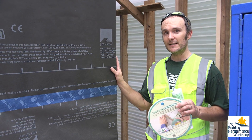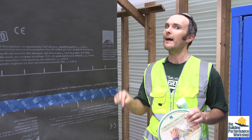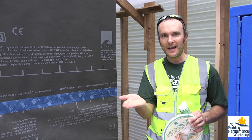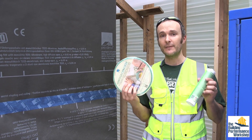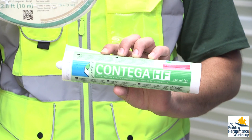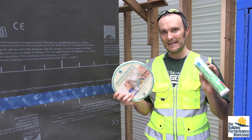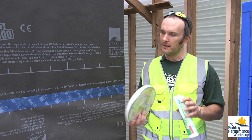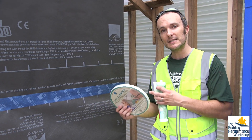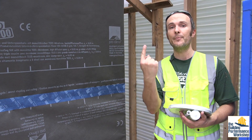In order to make this truly airtight, you need a sill gasket. At the very bottom of this membrane, I need to adhere it to the concrete — not to the bottom plate of the wall — because there is a gap between the wood and the concrete that is going to be an air leakage point. I have two options from 475 High Performance Building Supply: an adhesive that's like a caulk-applied adhesive, or this tape. These can, if applied correctly, serve as what's called a capillary break — keeping water in one material from wicking up into the secondary material. We're not worrying about that today since my slab isn't taking on a lot of water.